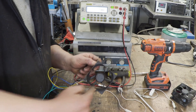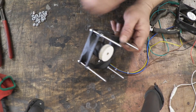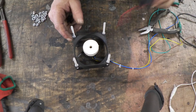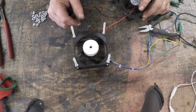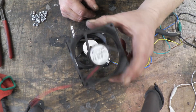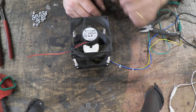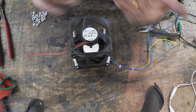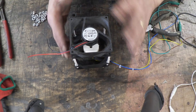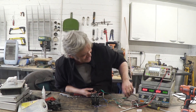Now we've created our three-phase generator, all we need to do is stick our DC motor onto it. I've glued a plastic disc on and stuck four bolts in. One thing that's not immediately obvious is that these things have to line up — if they're not lined up, they're going to shake. However, these things are made to incredible tolerances, so when I drop that on there and put a bit of glue, they're going to line up. If you get two fans the same size, you're not going to have any problems. There it is together — let's give it a bit of voltage.